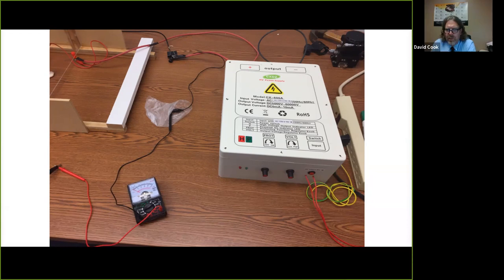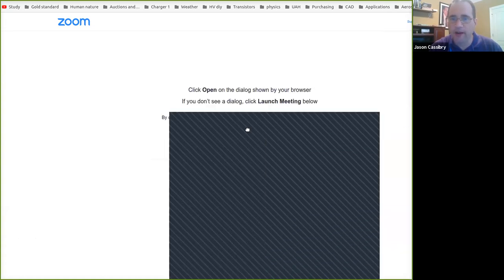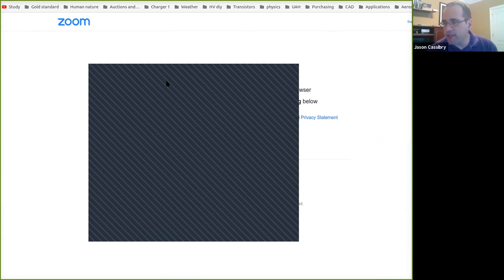I don't know if y'all can see the chat, but Tyree's asking if it can be less than 60,000. I think so, depending on how water behaves under various frequencies. The reason that we think that is because of the permittivity that I mentioned before. This is a very good question, by the way. There's a value for the DC voltage that we've applied and are studying, but the AC behavior is very different, and it depends on the material. We're basically like 70% salt water, essentially. So how does salt water behave in that environment? What's its effective permittivity as a function of frequency? And can we get away with something that's less scary than 60,000 volts? I think probably there are some promising combinations of voltage and frequency that would work that don't require crazy high voltages. We just don't know yet what those are, but that's one of the things we want to try to find out.